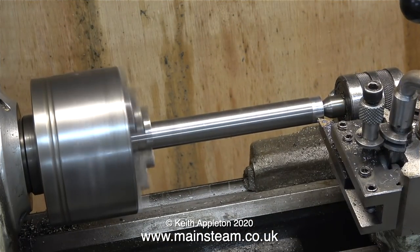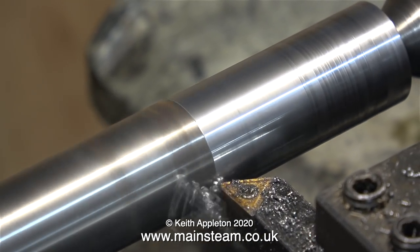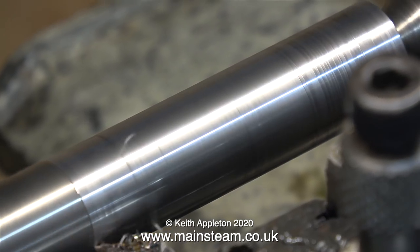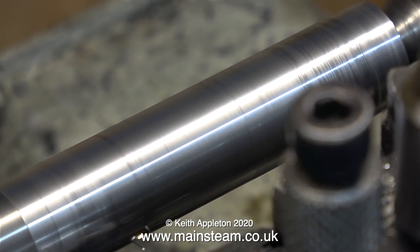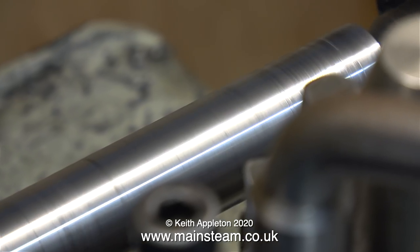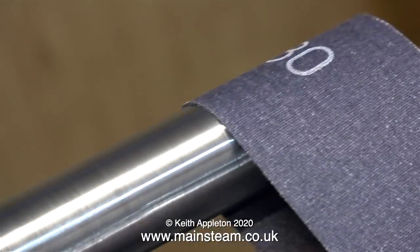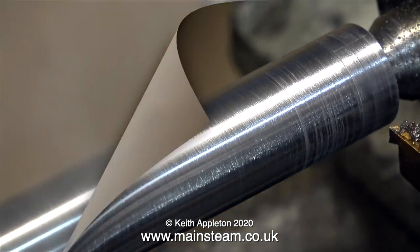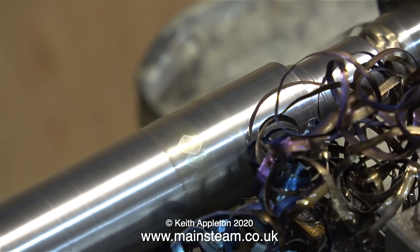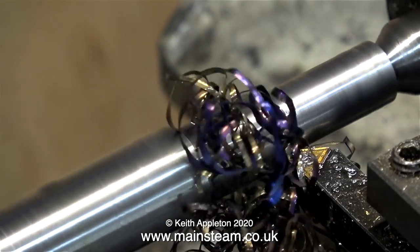Because this is a tutorial about plain turning, next I'm going to make the shaft that will go down the middle of the tailstock die holder. This is a piece of silver steel. Silver steel is interesting stuff - in its natural state it is quite hard wearing, but by heating it and cooling it a couple of times, called hardening and tempering, the entire piece will become very hard indeed. I don't need to harden this piece for this job, so I'm leaving it in its natural state. After turning it to the size I need, with one end in the chuck and the other supported by a live centre in the tailstock, this centre support spindle will fit into the tailstock chuck - that's why I'm turning part of it down to a size that will fit.